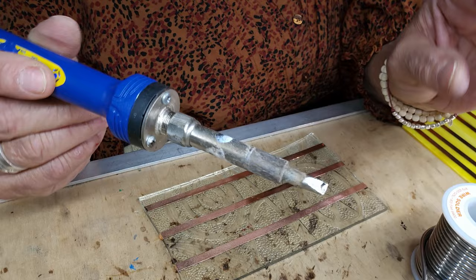The jewelry wire — there's certain ones you can solder to, but a lot of them you can't. It says jewelry on there because most of the wire work for jewelry, you do not need to solder anything. It's just a matter of making knots that go a certain way and it tucks in and behind. This is just something I picked up off the stained glass sites — it's pre-tinned wire. Now that I pulled it along the edge of my table, I've made it stronger. It isn't as pliable.